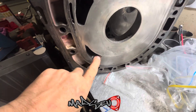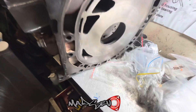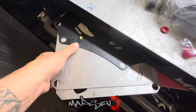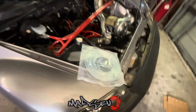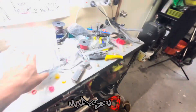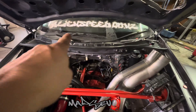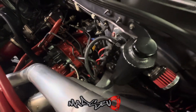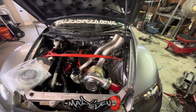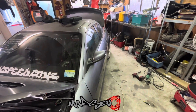That's pretty much the port I'm going to do — always do the exhaust one. It's actually a decent-sized bridge. These irons here are no good — that's the center iron — but I do have the porting template for the six-port somewhere down here. I'll get that done in the next couple of weeks. As for this thing, I've just received some brake line and I've got some heat shield and a few bits and pieces from Alien Speed Parts — definitely look them up if you need anything. What I'm worried about is heat exchange through here to my coils, so I have to build something in there. As soon as those brakes are done I'll be able to drive it out of here.